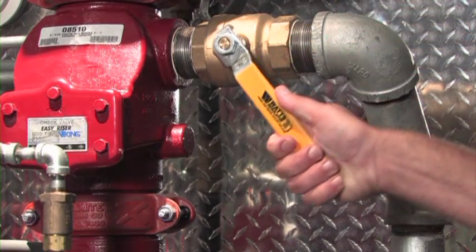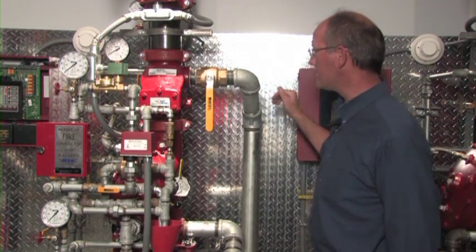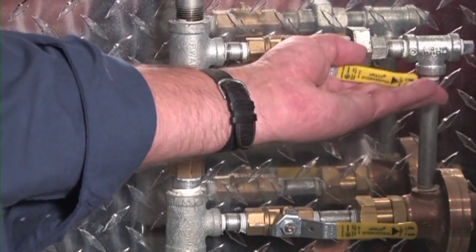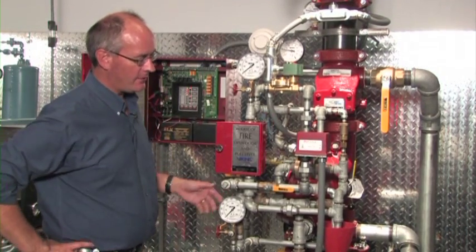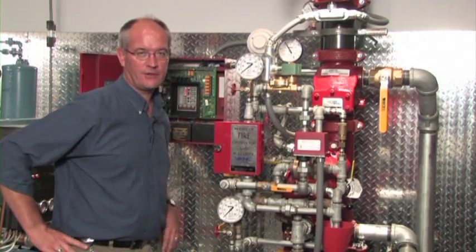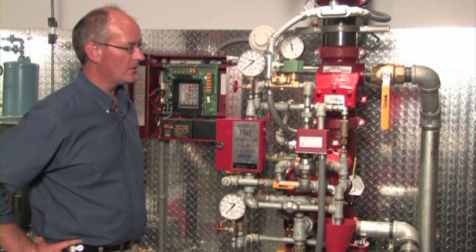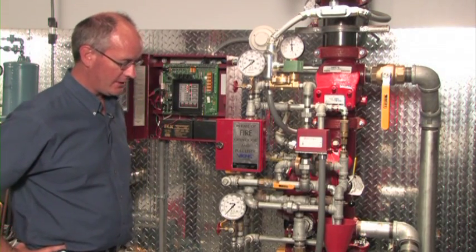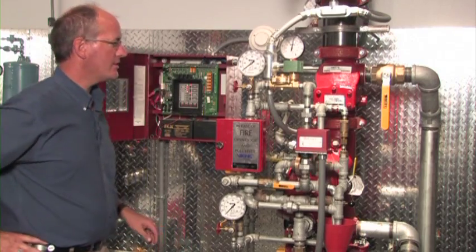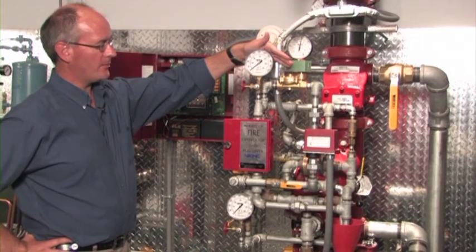Once the riser is drained, you can re-establish air pressure into the sprinkler piping network. You'd have to repair the sprinkler if it were fused, or if a pipe were broken, that would have to be repaired as well. While you're refilling the system full of air, you want to open an auxiliary drain valve connected to the deluge valve riser trim. That will drain down the deluge valve and any water that's been left residual in the trim of the deluge valve. Once that's completely drained, close the auxiliary drain valve and you're able to reset your release system, which will take the power away from the solenoid valve and close it and pressurize the priming chamber.